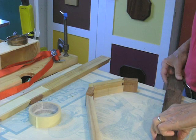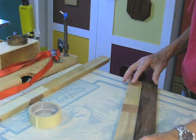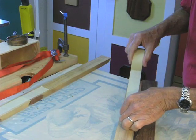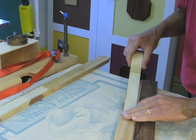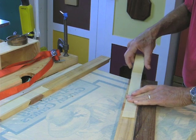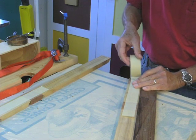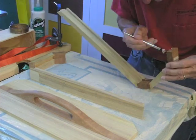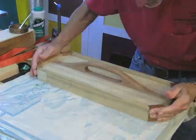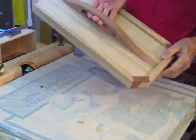The lid glue-up is similar, except I've used only two steps because there is a lot less glue to apply. Masking tape is again very helpful, but it must be applied to the loose parts using a straight edge, as shown. Using the same technique as on the box body won't work because the band clamp on the smaller lid parts interferes. Let's just zip through this lid glue-up — it is repetitive. And there's the completed lid.